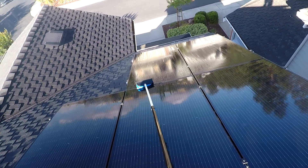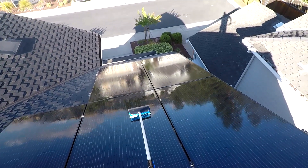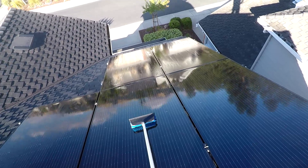When you're cleaning your panels, make sure that you get all the dirt off the bottom of the panel. Gravity does its thing — if you live in a desert area or a really dry area with a lot of dust or pollen, gravity is going to pull all this dust and dirt down to the bottom of the panel because there's a little ledge there where it gets stuck. So make sure you clean all that off. And after you clean the bottom of the panels, make sure you wash your brush off so there's not a ton of dirt on it that you'd risk rubbing on other panels and scratching them.